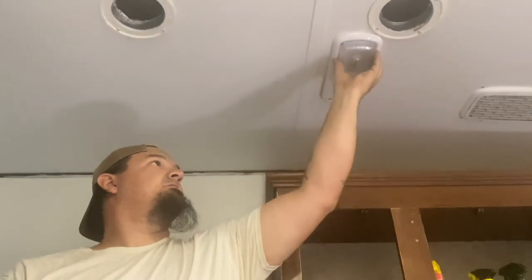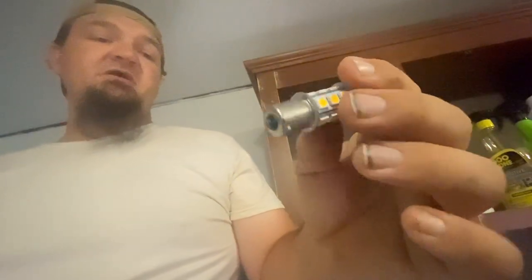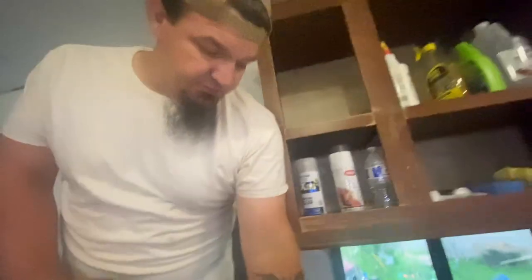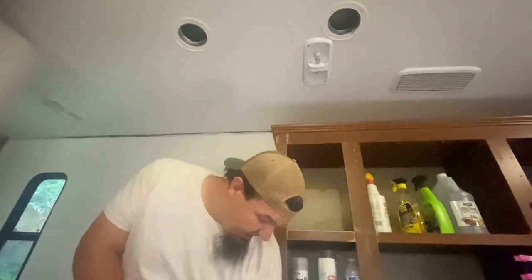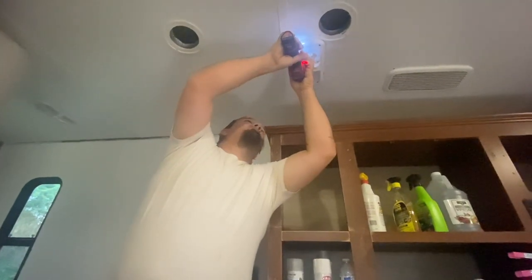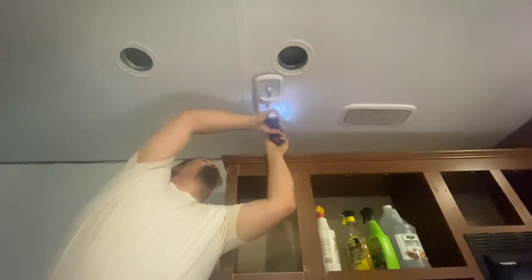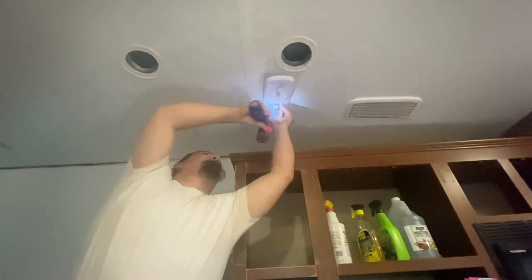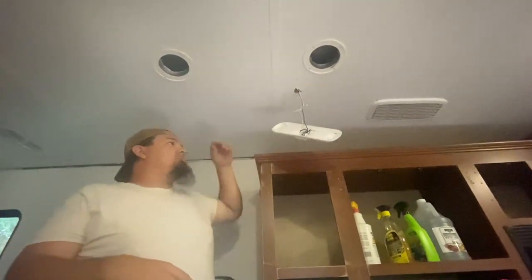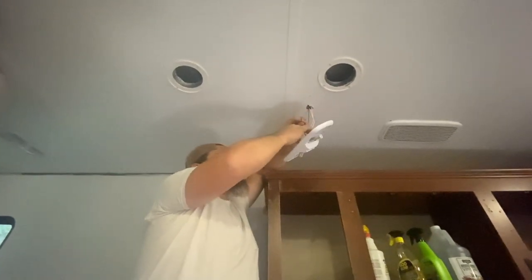Let's change out a light. These are those corncob style bulbs — you've got to push them in and twist. They're not difficult, but I'm an electrician by trade and I want all my lights to be the same in here with the same coloring. So I'm going to change it out to this new fixture. There's nothing wrong with this one — it's a really good light overall — it just doesn't match the rest. I've already taken this light down before, so I only have two screws holding it up. As you can see, I've already changed out the wire nuts; they were the old crimp style. I like wire nuts because I like being able to work on things, and as an electrician, I know how to work on electrical safely.